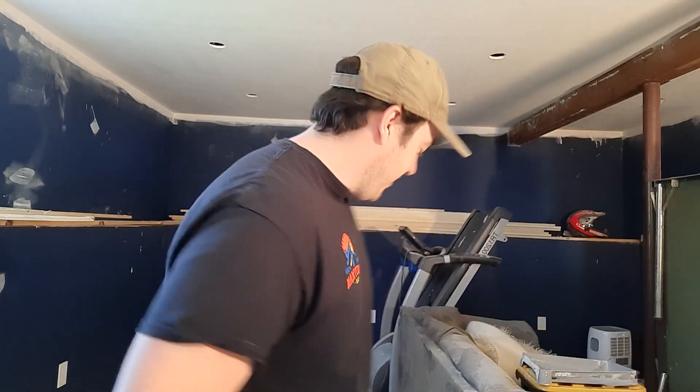What I wanted to go over today is what do you do with new drywall. A lot of people say a lot of different things, and the best thing I found is that regular Kilz or Kilz 2 just doesn't work. It'll go on new drywall and over your mud — or compound if you want the correct term, I call it mud — but it just doesn't cover it quite well. You could do three or four coats and it'll cover, but there's something better.